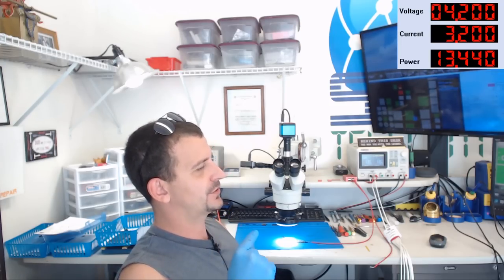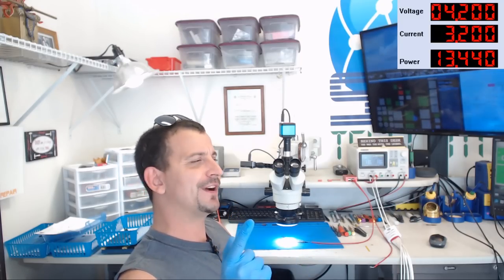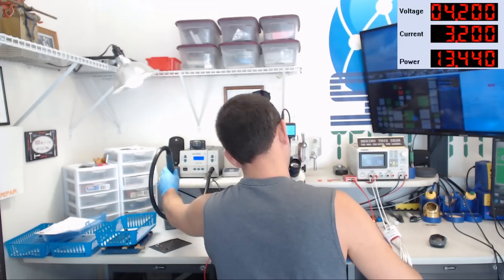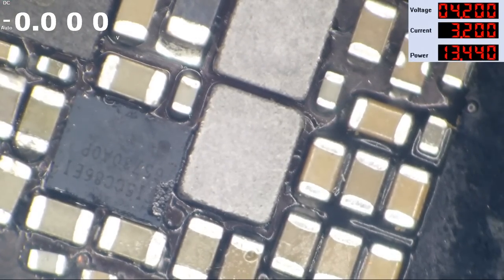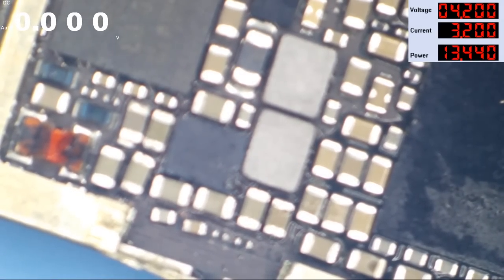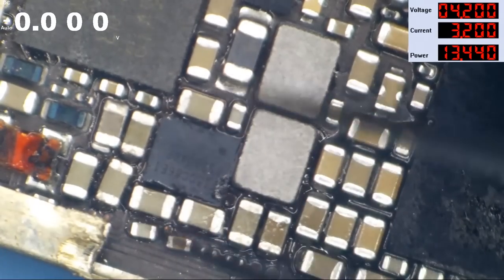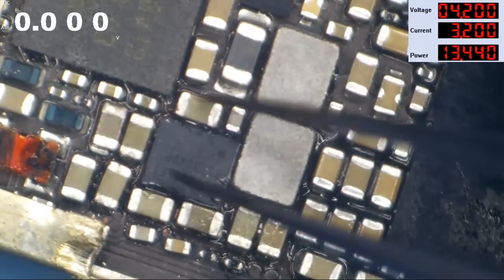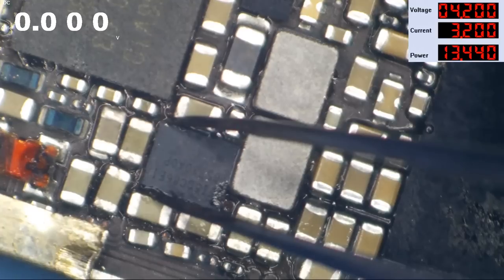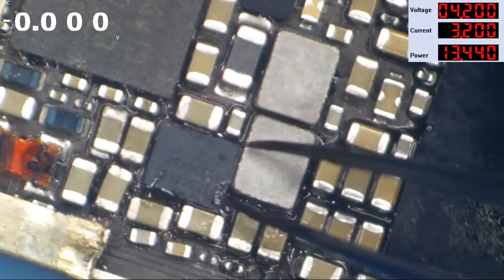I'm really thinking this started with no image and maybe they botched it with chestnut. They were smart enough to carve out the shield and check the I2C lines, but they were also clumsy enough to gouge stuff off the board. Let's go ahead and remove their chestnut IC, gradually warming it up. God bless the last tech for using lead-free solder.